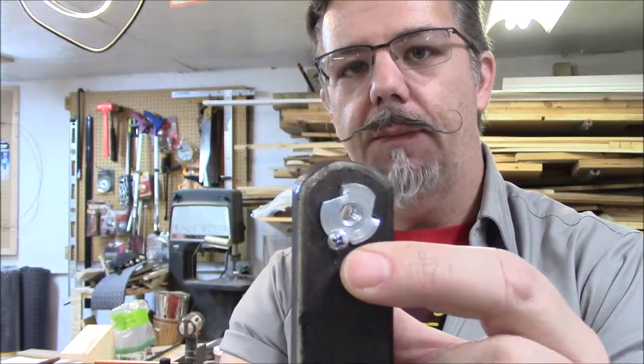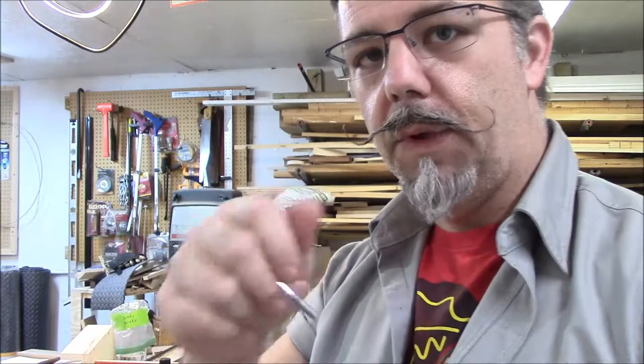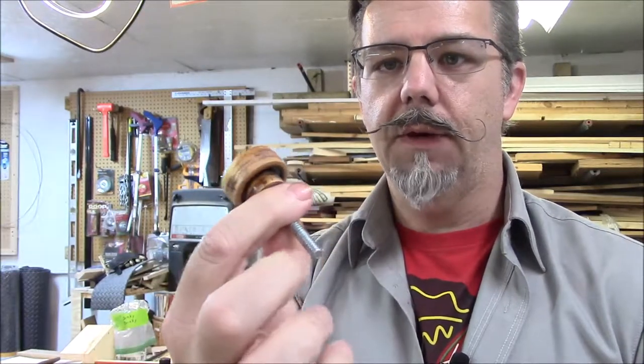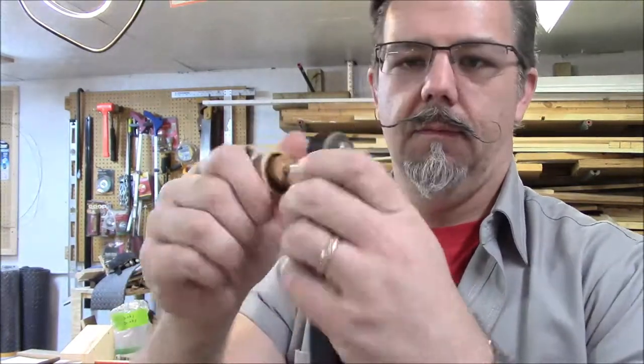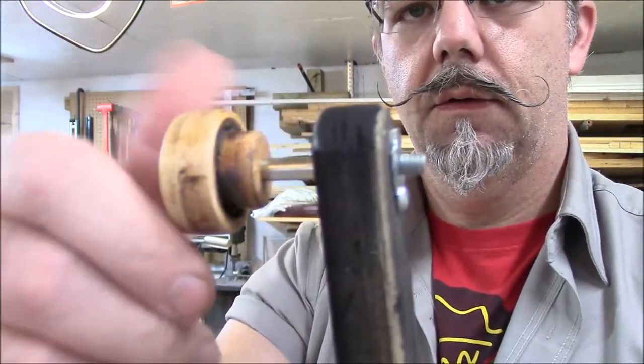I decided to make a design change. I didn't want to deal with a wing nut where the other side of the bolt moves on me. So on one of the sections, at each end I added a T-nut with a little screw to prevent it from spinning — on both ends. Then instead of wing nuts, I made little wooden knobs. They didn't quite turn out the way I wanted, and I did film some of it, but I will remake them and put out a much better video on that.